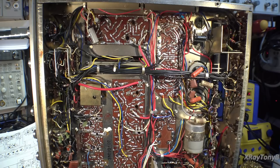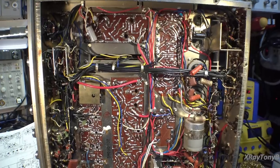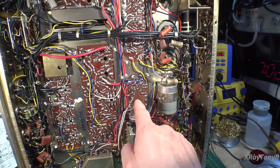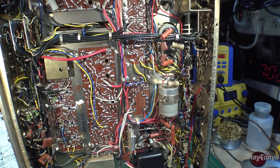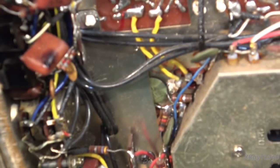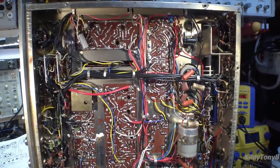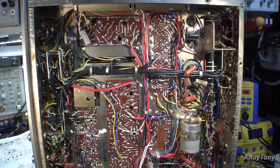You can see the protect board right there, and it also has the high voltage section — those two diodes provide around 150 volts to feed the vacuum tubes. The wiring going to this section is going to have to get redone because whoever put it back together pinched it in there pretty badly. But I'm a little more confident now that we can continue on with this project. Let's get the outputs fitted in and see if we can get this amp to bias up.